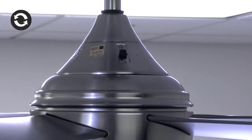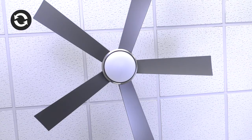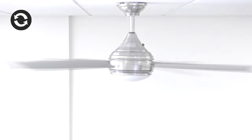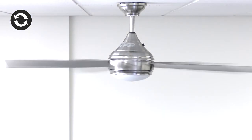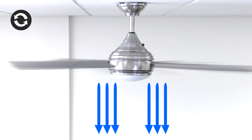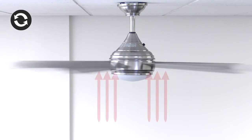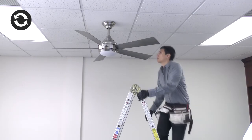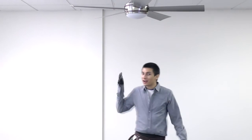Sliding the switch to the off position will turn off both the fan rotation and the LED light kit. On top of the motor is the reverse switch. The reverse switch can be moved to change the direction of the fan rotation for warm weather or cool weather. For warm weather, the fan will spin counter clockwise and push air downward to create a cooling effect. For cool weather, the fan will spin clockwise and cycle warm air off the ceiling. Note that the fan should be stopped before changing the direction of the blade rotation. Congratulations! Your Hanlon ceiling fan is now ready to use. If you have any questions or need over the phone assistance, please call the service number in your owner's manual. Customer service representatives will be happy to assist you. Thank you for watching!